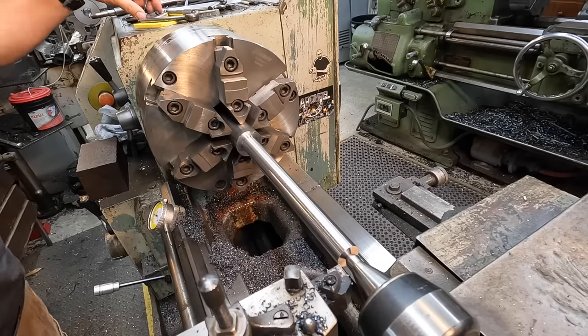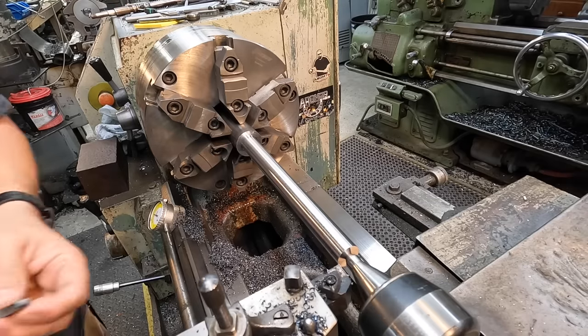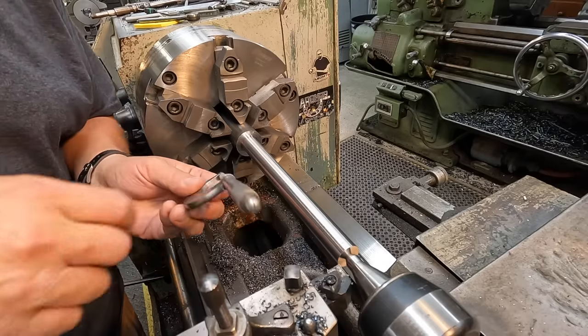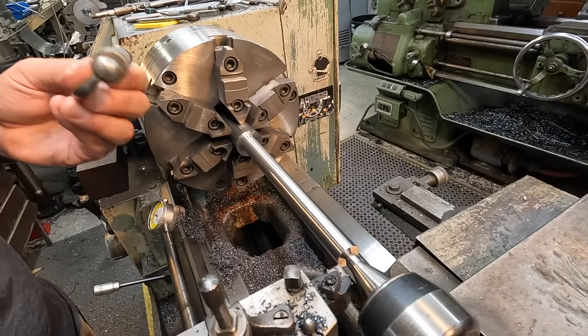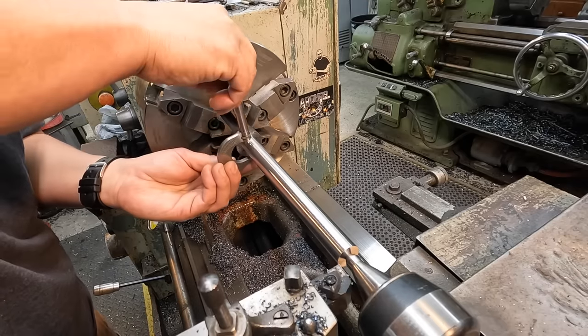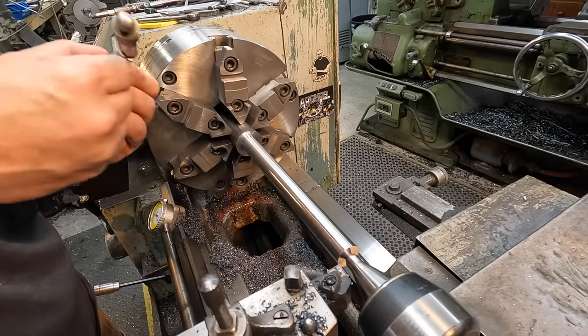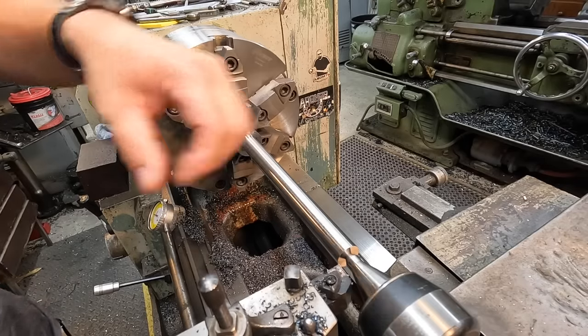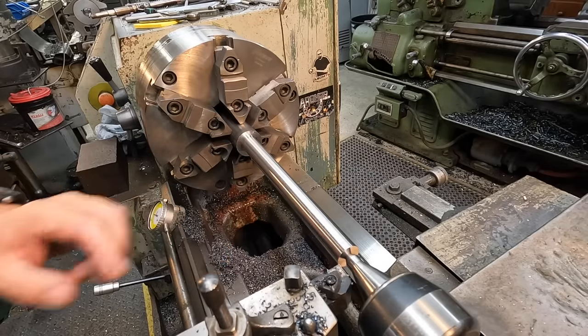We're getting close. We should have about an eighth of an inch still to come down, going from 1.5 to 3/4, so just taking 1/8 passes each time. We've got about 112 thousandths. Right now we're getting about 1/1000 taper from end to end there. That should straighten up as we get down to our finish cut.